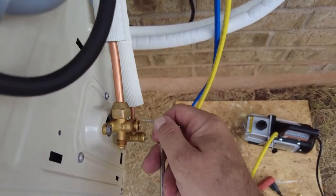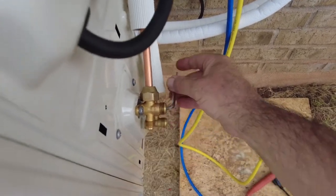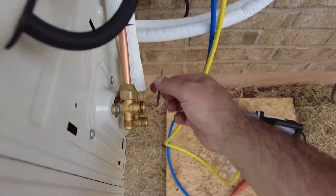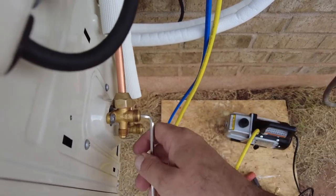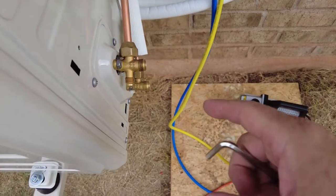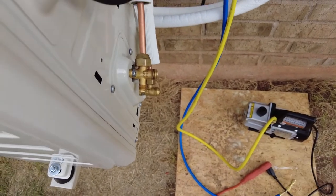Take that off - as she was hissing as I was pulling it out, that's just basically pushing out whatever little bit of air is left in there. You're not losing all your refrigerant. Now we open these service valves up all the way until they stop. Do not force them once they're open and they stop - that's it, don't crank it because it could pop out on you. Now the system is fully charged. Put the caps back on and get the power going to fire this up.